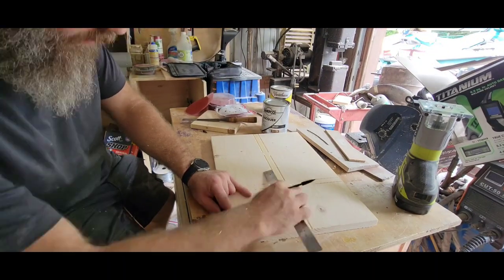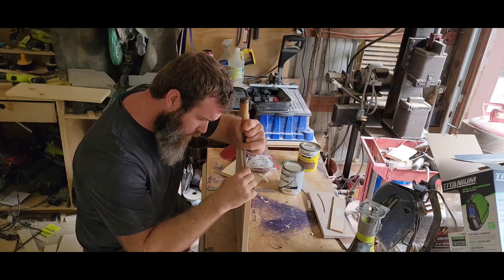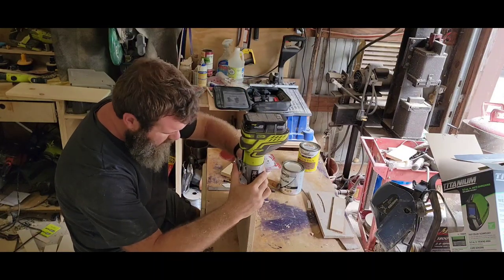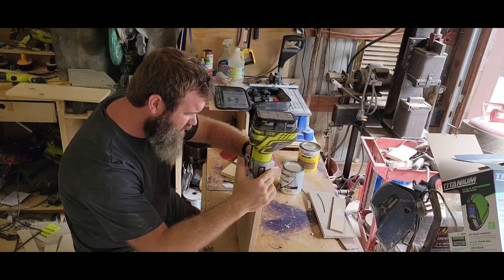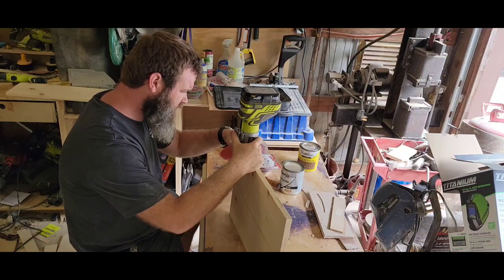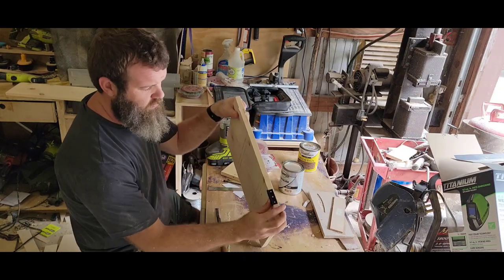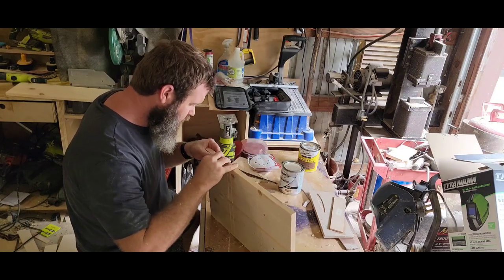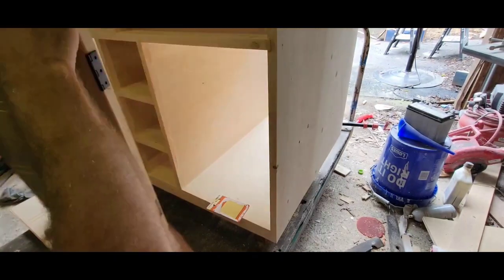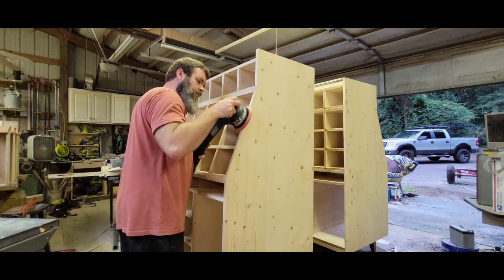Now I'm putting the hinges in. I lay the hinge on there, trace around it, then go over my pencil line with a chisel to get the cut started. Then I use a quarter-inch router bit to route out all the extra material — pretty quick and easy. I just have to clean up the little corners with my chisel since the router bit is rounded, then lay the hinges in to make sure everything fits perfectly. Then I do the same process on the cabinet: set the door in place, mark the cabinet using a hinge to lay out where it goes.